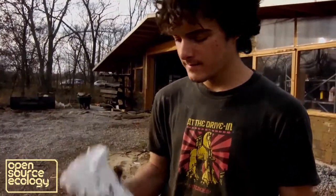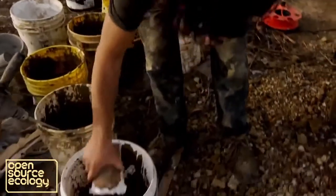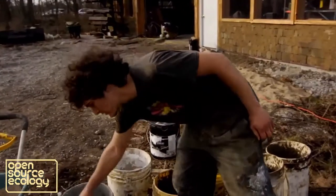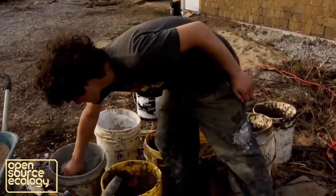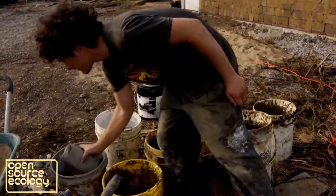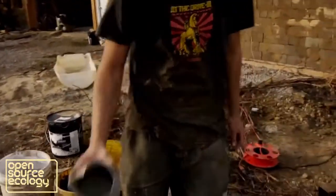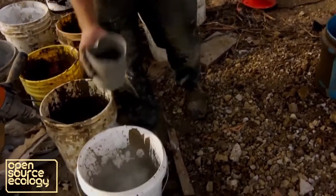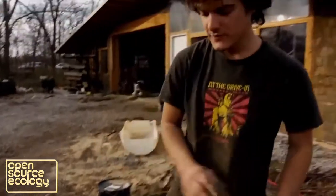This is like half a coffee cup of lime — just 5%. Keep that in mind; you don't really have to be so precise with it. The ratios will vary depending on your soil and it takes some experimenting. I'd recommend mixing up a few different types, noting what your ratios were, doing a test portion on the wall, writing down each ratio, and figuring out what's best for your soils.